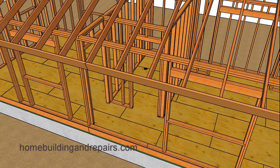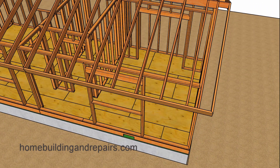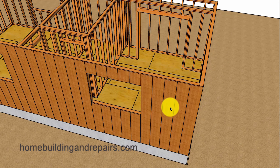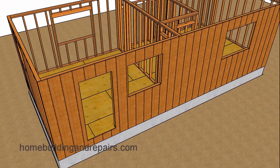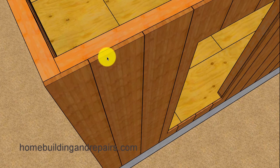Could it be the fascia board? Could the fascia board have actually been strong enough to provide support in the areas where we needed it? Along with the 1 by 12 vertical siding — siding that was actually 1 inch thick and 12 inches wide. I believe this is the main reason why the top plates weren't sagging, and I think even if we would have changed the direction of the siding and ran it horizontally we could have ended up with the same situation.